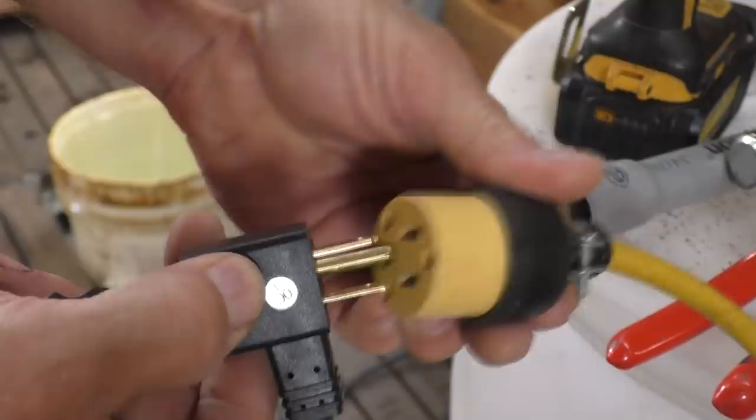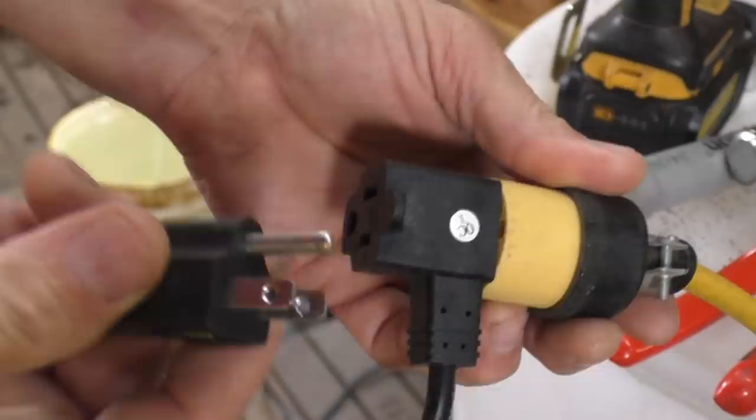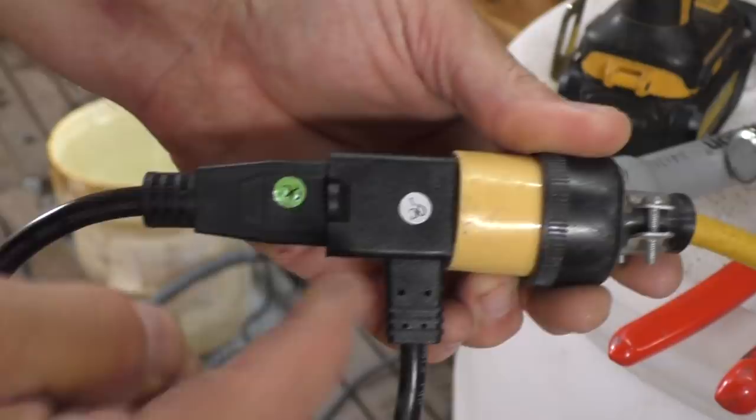The wiring is really simple. This is the float switch and it's easily replaced with another one. This is the pump — once the float switch is activated, the pump has power. As soon as the float switch gets all the way down, it cuts off and there's no more power to the pump.